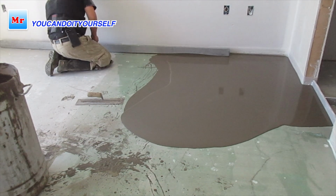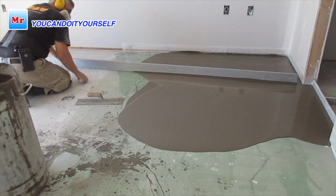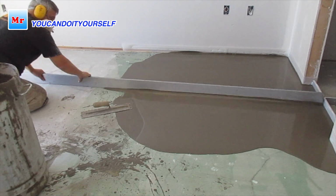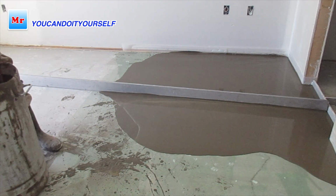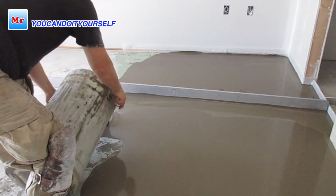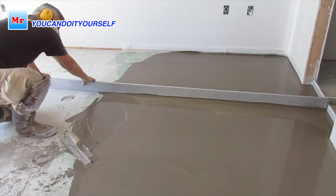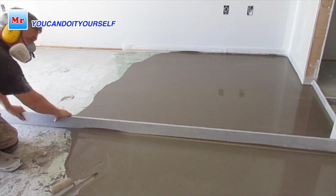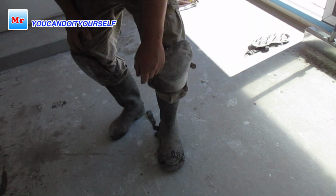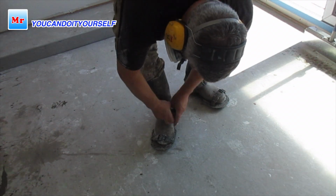It's very easy to do with a straight edge because the whole floor is flat, and I just need to slide the straight edge and hold the way. The self-leveling compound will stop in front of the bathroom and the entrance where I put a piece of drywall. For walking in the hallway area, where there was the deepest spot, I'm using spike shoes.